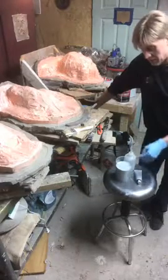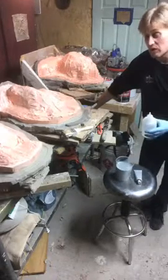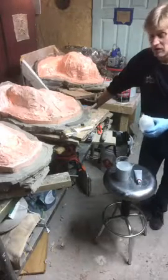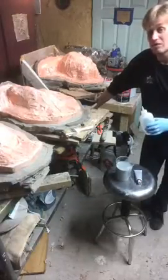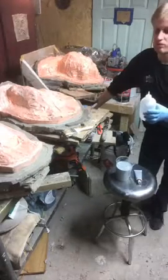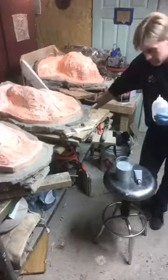And I'm going to put a little extra drops into my resin so that it kicks a little quicker too, because both need to be hard and done for this to work. If you mix one of these without doing the other one, you're toast, because the thing will never kick right, never cure. It'll be a slimy mess, and you're going to spend a bunch of time scraping it off. So I've got my tip cut, so one small squirt is about 10 drops. If we let Becky use and squirt it, it's like 40 drops, so it's never as good.